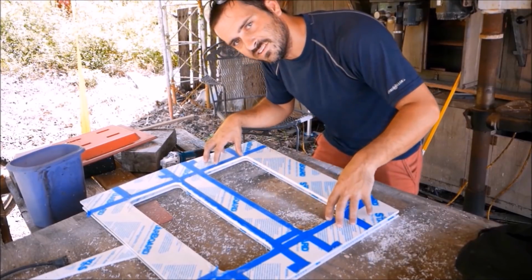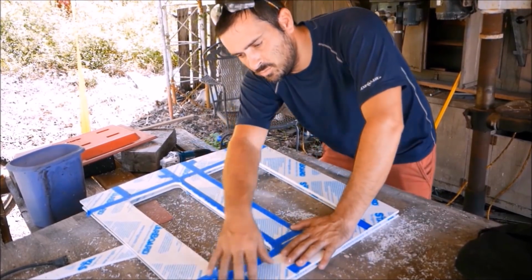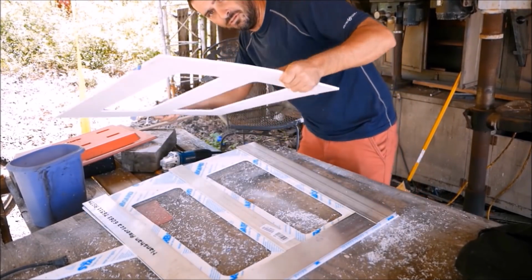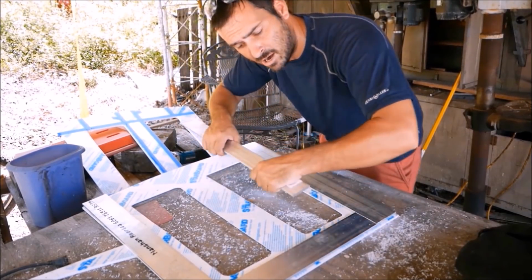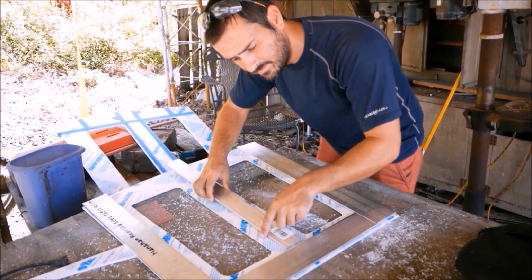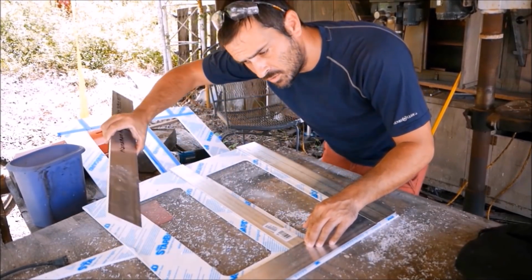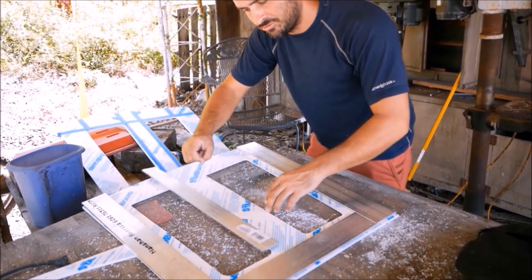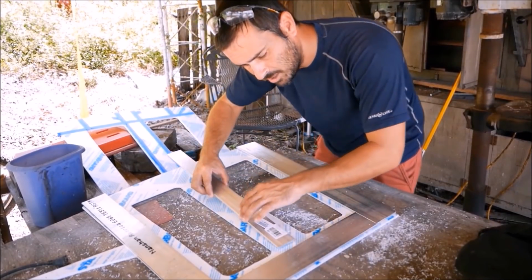This is the way that sandwich construction, that I was trying to explain earlier, is going to work. So we have one solid piece of 1/4 inch starboard on the outside, still flexible. What's going to add the rigidity are these aluminum bar pieces. They're 1/4 inch, just regular 6061 aluminum. Not real worried about corrosion on this. 3 separate pieces. And then, of course, the inside section of plastic starboard as well.